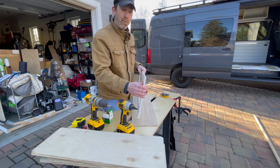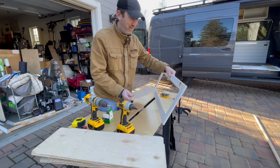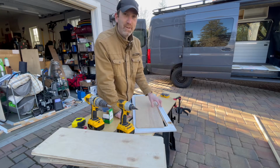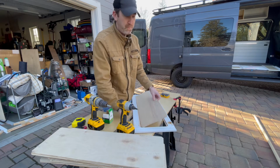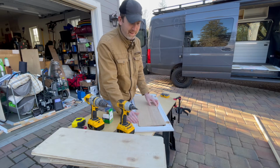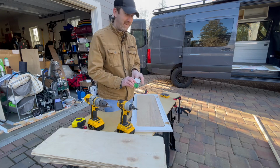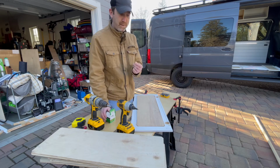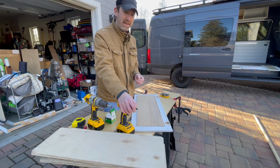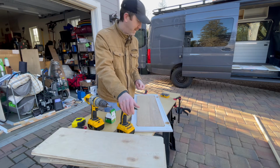So the light is great, but the 1/2 inch isn't so great because everything is built around 3/4 inch, including brad nails and the staples you might use to attach this to the back. So I ended up needing to go to screws because I just couldn't find anything that would fit. I ended up choosing a number 6, 1/2 inch screw because I happen to have a number 6 counterbore in my set. It's the smallest one I had, and I didn't feel like buying another one for this.